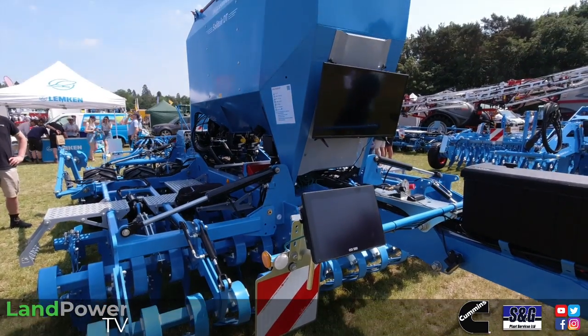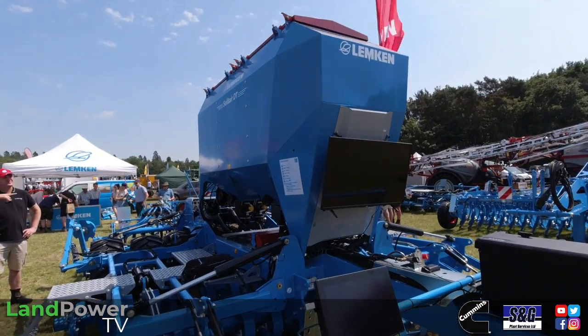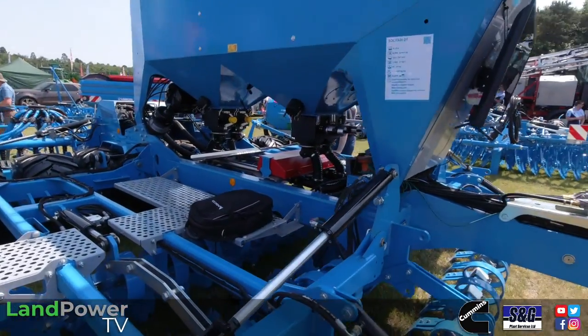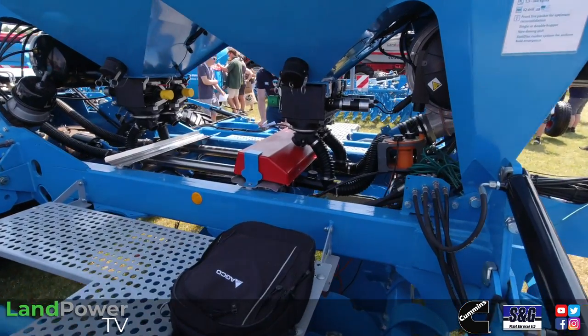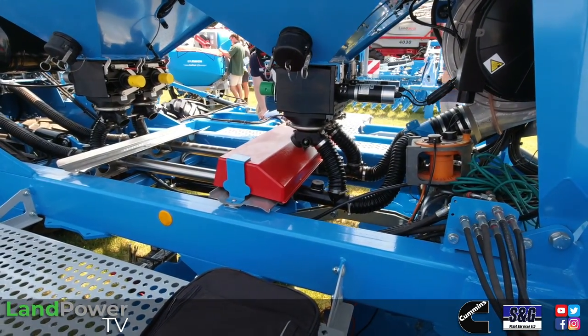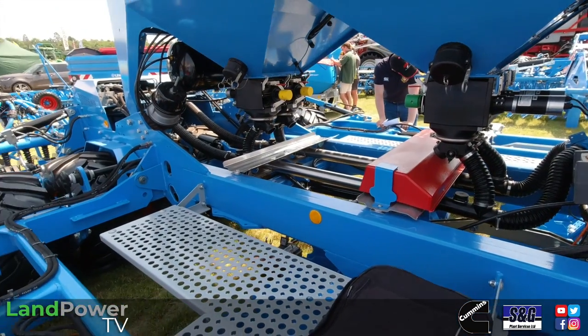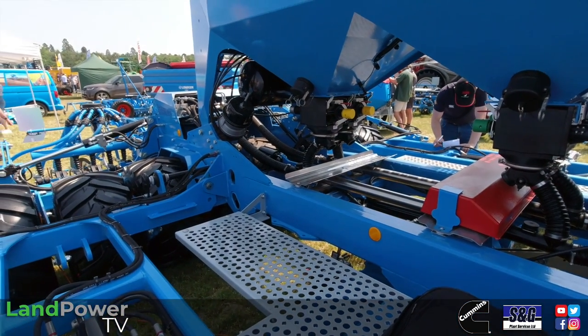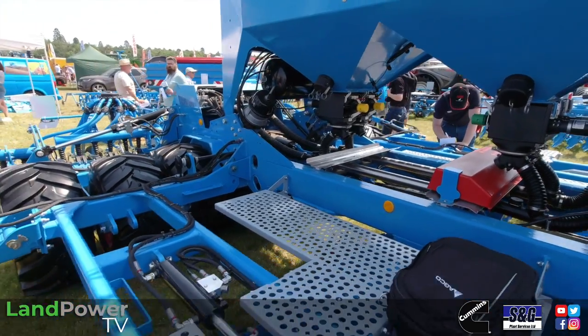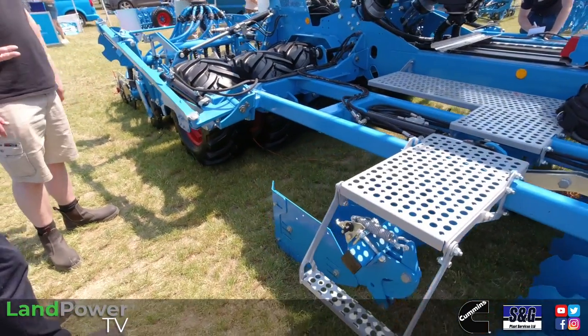We meter out from the bottom — whether it's two seeds or grain and fertiliser, we meter everything into one pipe. It's what we call a single shot system: everything ends up mixed. If it's grain and fertiliser, everything is mixed to the coulter bar, to the heads, into the coulter. There's also a gap here because we can run a fertiliser bar as an option.